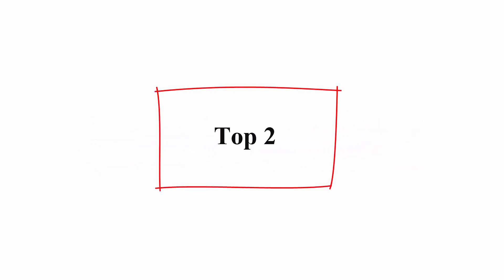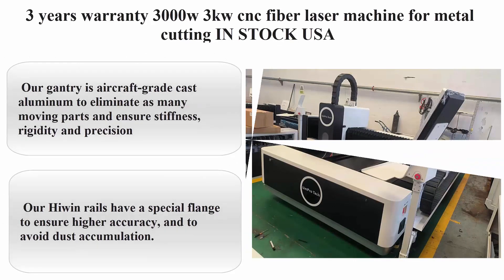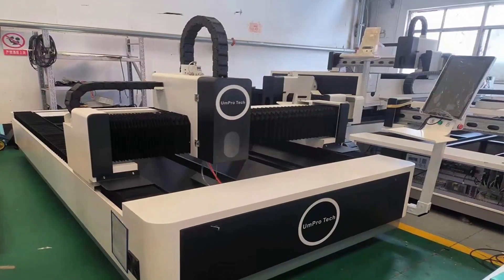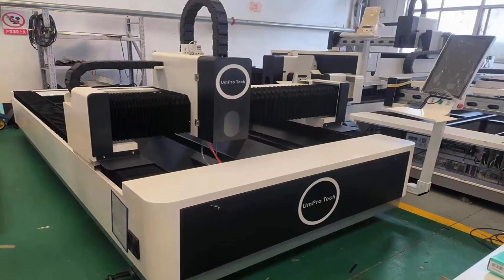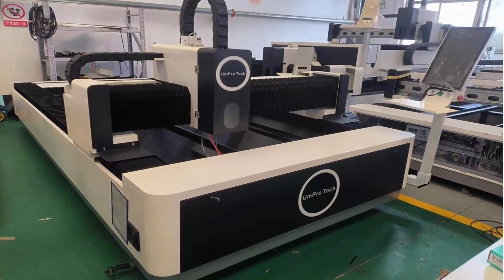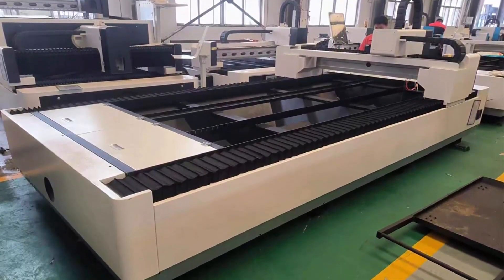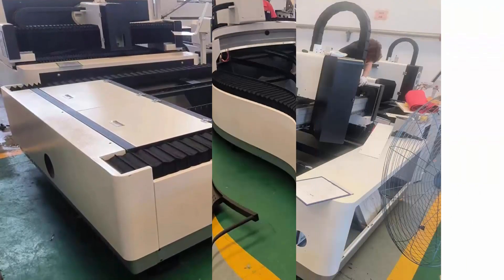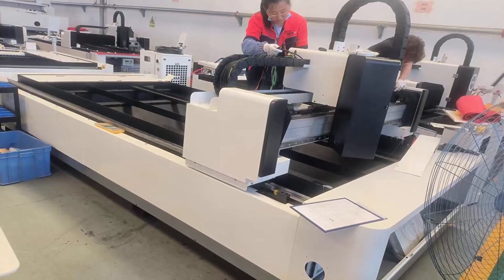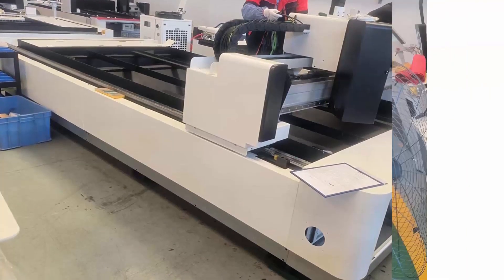Top 2: 3000W 3KW CNC Fiber Laser Machine for Metal Cutting, in stock in the USA, with 3 years warranty. The gantry is aircraft-grade cast aluminum to eliminate as many moving parts as possible and ensure stiffness, rigidity, and precision. The linear rails have a special flange to ensure higher accuracy and to avoid dust accumulation. Cutting Area: 51 inches × 98 inches.